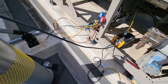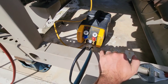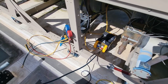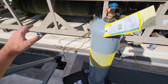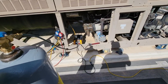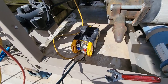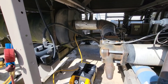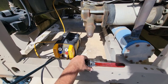We're already good there — we're looking great so far, right at 80 pounds, chugging away with the recovery. We've not even begun to build tank pressure whatsoever. It's a real nice cool day; the sun's starting to get on the tank, which I'm a little nervous about, but it's not impacting it near as much as I thought. There's not much load out on the system. I didn't expect it to give us any trouble during the recovery. This is 134a — this is a YC IV machine for those who are interested. Highly recommend looking up the manual on it.